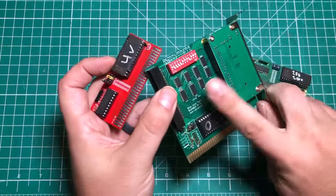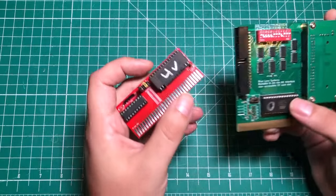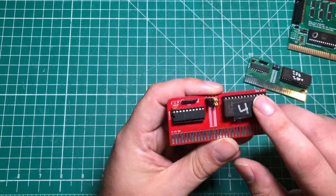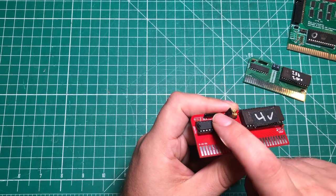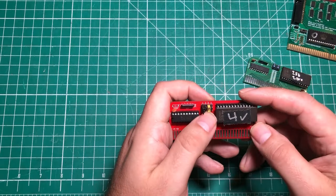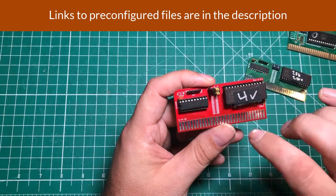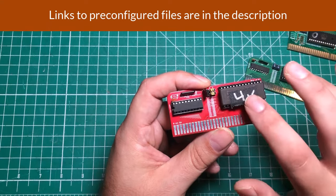So I'm going to show you what it is as opposed to all the components you see here — a compact flash reader, a whole bunch of logic chips, a ROM, switches, jumpers, and things like that. This one is very, very simple. It is a ROM, an LS688 logic chip, a 10k resistor network, two capacitors, and places to put some jumpers. The real magic is in the fact that I took the time to work out all the details so you can just download the ROM and get going.